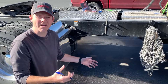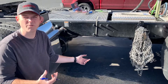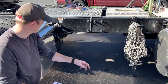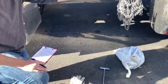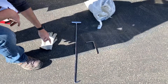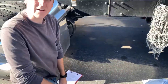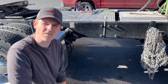So we're over here on the passenger side of the truck. On Doug Andrews trucks, just about every one of them has a chain hanger on the passenger side. This is where generally you'll put your chains, unless you have brand new ones in bags — then you put them generally under the bunk. This truck right now has chains on the chain hanger, and I also got a brand new bag of three railers. Three railers go over full tires on a tandem, whereas singles just go over one tire. In front of us here we've got our chains, and then I've also got just the tools that I recommend that you have. The one that's most critical is this cam lock key — that is what you'll need to tighten down the chains. I recommend gloves, always. And then one thing that's really nice is getting your fifth wheel puller, which helps you pull the chain through in between the two tires. So that's basically what you need to get started with chaining your drive tires.